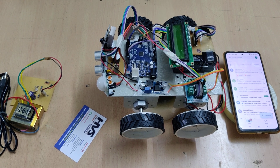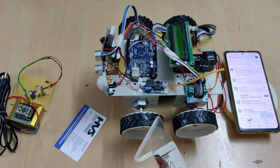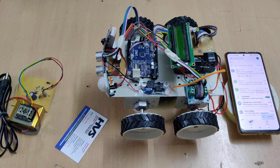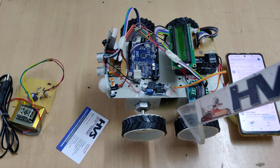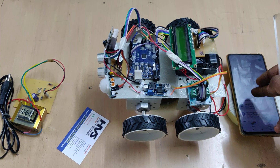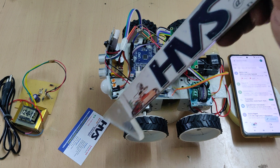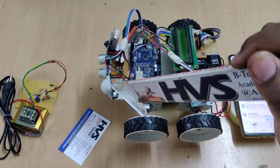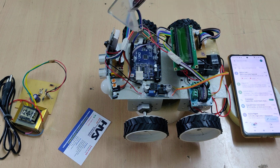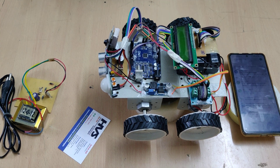Welcome to the project demonstration of a human detection robot with email alerts of person images using ESP32 camera. This robot consists of an obstacle detection sensor SR04 — whenever an obstacle is present in front of the sensor at a distance below 30 centimeters, the robot will stop, take the left direction, and check for obstacles again, continuing left until the obstacle is avoided. While moving, if motion is detected, it is identified by the PIR sensor, which informs the ESP32 camera with a buzzer indication, and the camera takes a picture and sends an email to the registered email ID using the hotspot.